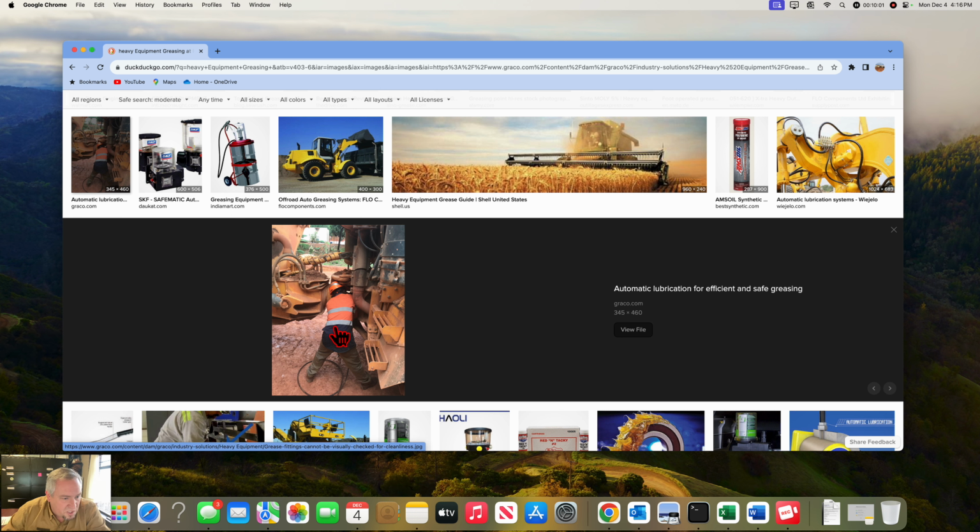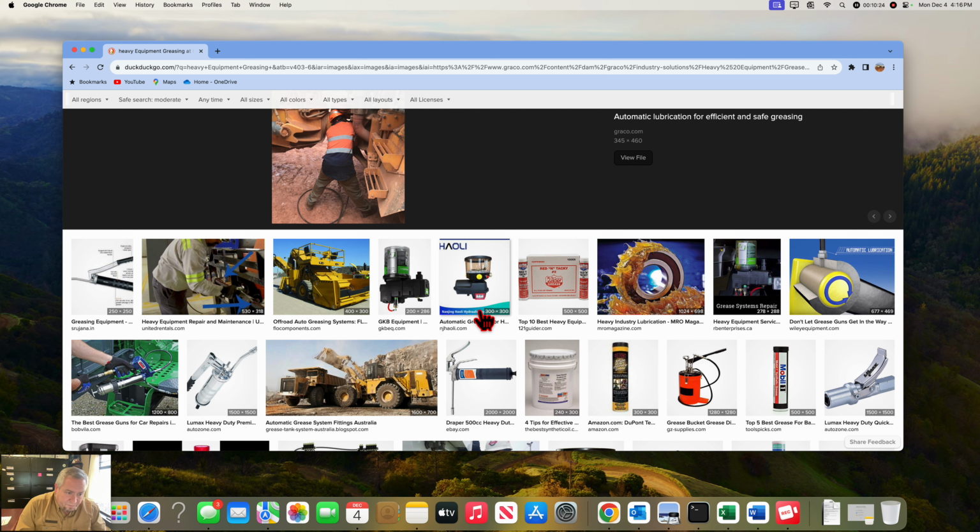So when you're greasing your machine, I want to make sure that you have the keys in your pocket. If not, you have the kill switch in your pocket. Do not go around your machine without that, because somebody may hop into it, maybe having missed their walk around. Make sure that you're being safe when you're greasing your machine. Make sure you're watching conditions. Simple things: watch out where your head goes, because you'll bump into the thumb and bang the corner of your head. You're supposed to have your hard hat on, but things happen. If you're greasing around the thumb, you never know, the hydraulic line could cut loose and fall down on you.